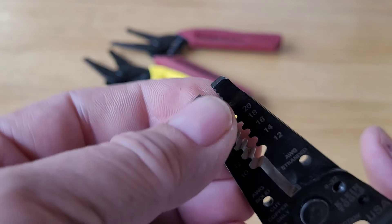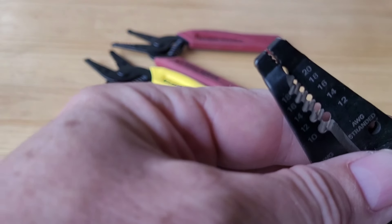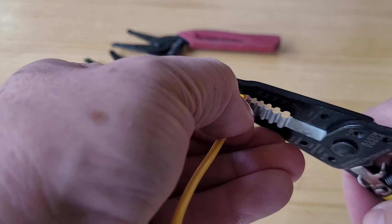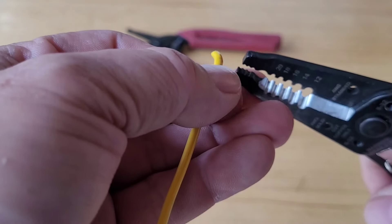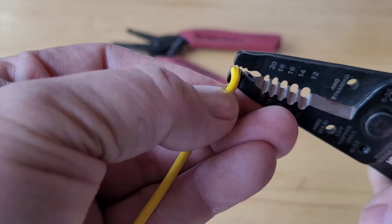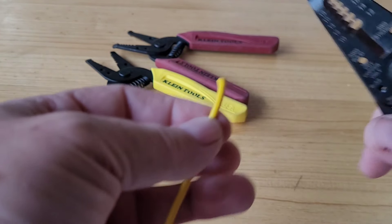Just below that, there is an arc-shaped opening. I'll close it so you can visualize it better. This arc-shaped opening serves to grip and pull to assist at the moment of stripping the wire. For example, when you strip the wire and the insulation is hard to remove, you can hold it here with this angular, rounded arc-shaped part and pull. You can also do this with the top part where the straight teeth are, but that will crush the wire. The arc opening lets you hold it gently just to assist in pulling during wire stripping.